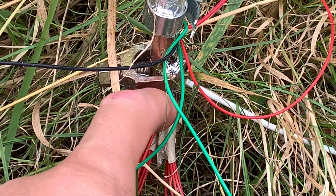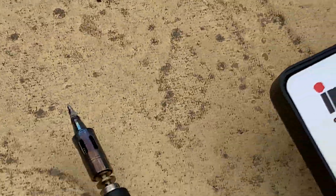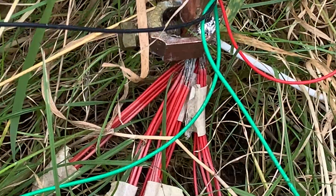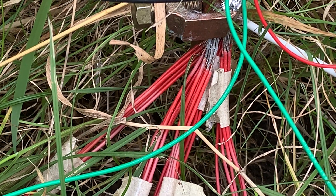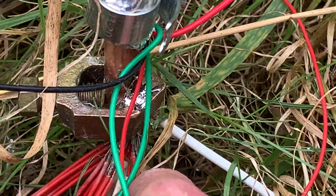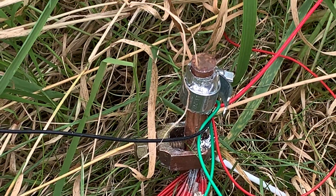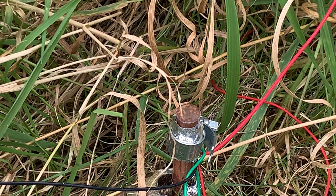These radials were put down earlier in the summer and they're still looking pretty good. Using my Iroda butane soldering iron, I managed to get enough heat in there. I tinned all the separate conductors and basically ran solder across all of them, effectively attaching them together with a big lump of solder which you can probably see there. It's not exactly a neat job but I think it'll be effective, so I'm hoping I've improved my earthing system for this end-fed wire.